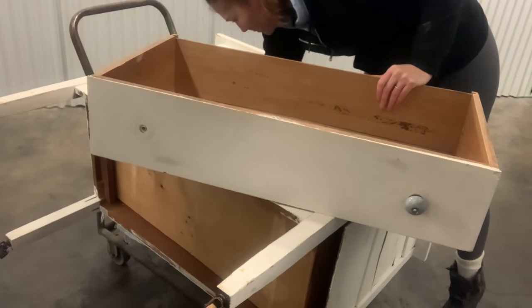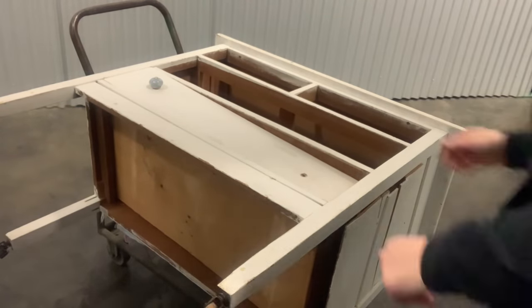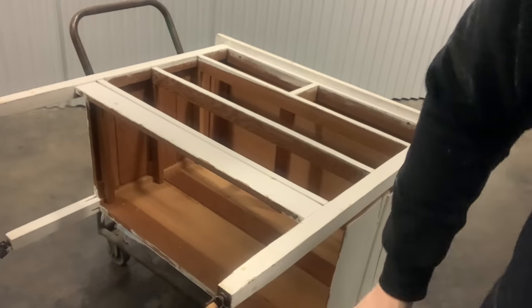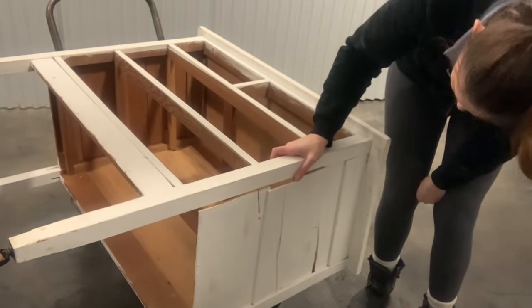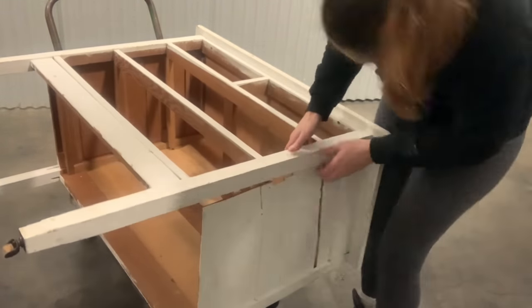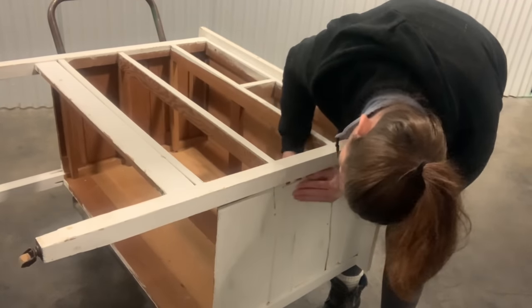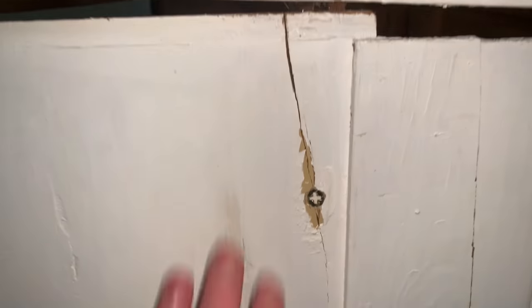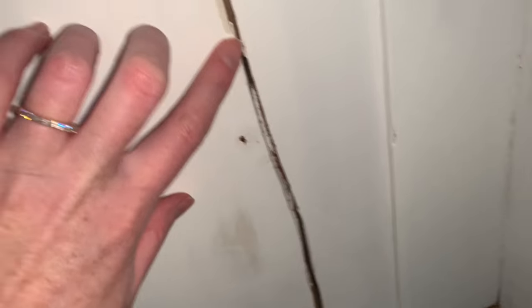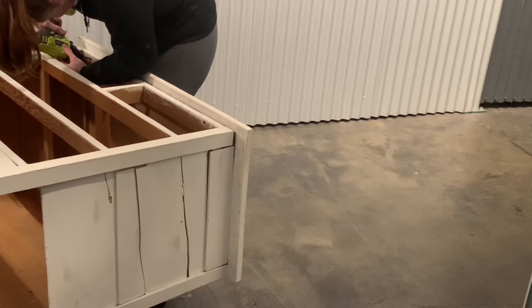It was an estate, so we're going to fix her up and all will be right with the world. What I'm doing with this process is going over everything as I'm taking all the drawers out, because I can clearly tell that there are issues with this. I want to make sure that I go over every single piece and figure out what I'm going to need to do to fix it. As far as the side goes, I know I'm going to want to completely remove these — they slide into grooves in the legs and that's what holds this piece together. I couldn't get these out until I got a little closer and realized they had done a patchwork over a screw and painted it so I couldn't see it. So there are a few screws in here that don't belong. They just didn't really fix anything when putting this back together — they'd throw a screw in. There's paint in between all of the cracks, so we're going to do our best to get this old gal fixed up.